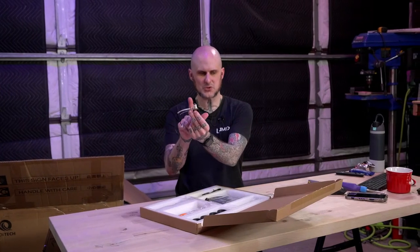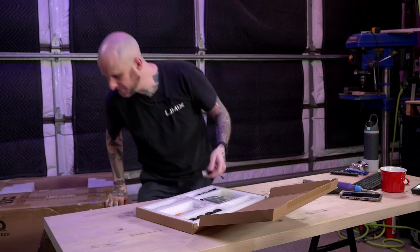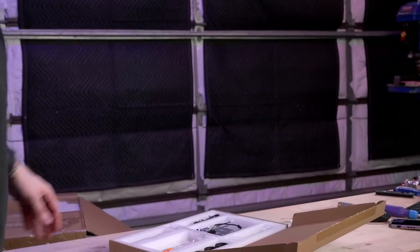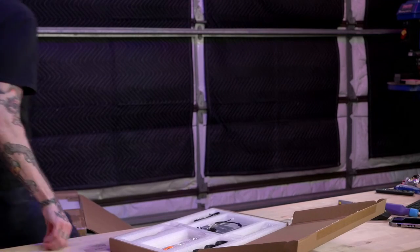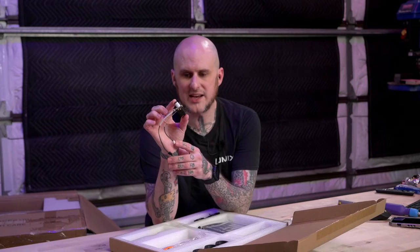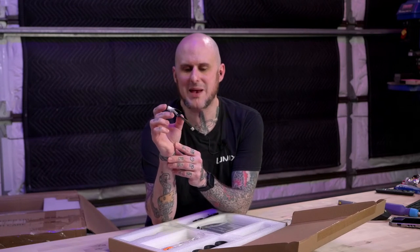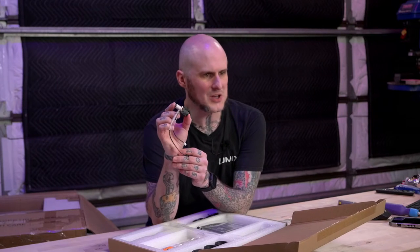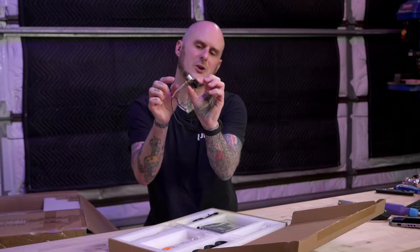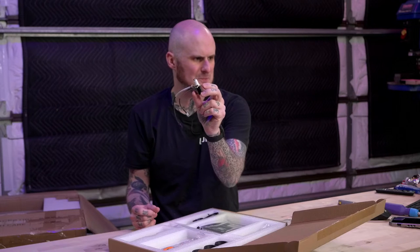Yeah. So it's got a ceramic heater element. Let me zoom that camera in as far as I can. I don't know if it's going to be nearly enough. It's better. So it's very, very reminiscent of a Bambu hot end. So what we're looking at is basically a Bambu hot end with a ceramic heater element of like a Rapido, a Phaetus Rapido, attached to the end of it.